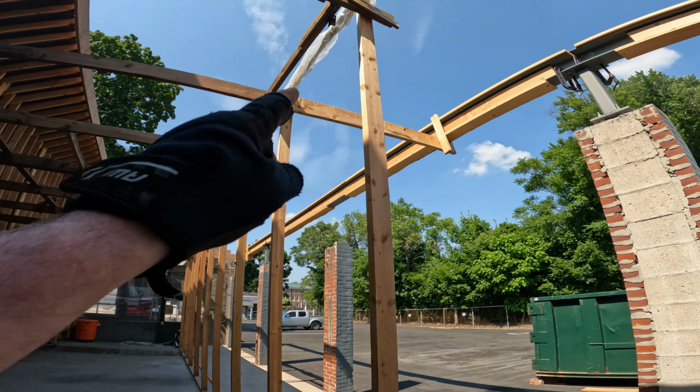This beam looks good though. It's nice and level, nice and straight. So yeah, once this beam is in, then we go to town framing rafters, and that's it. Start building our truss, hanging that LVL ridge beam, and really start buttoning this job up.